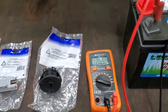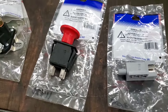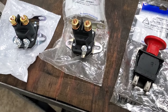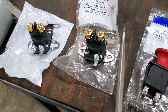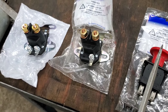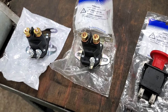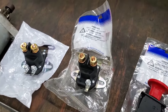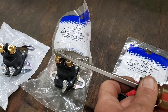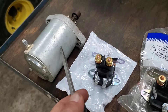We're going to skip the safety switch and the PTO switch for now, but we'll come back to them. Once you know you've got good voltage, the quickest way to find out if your starter is working — this terminal goes to the positive on the battery, this one goes to the starter. Take your screwdriver and jump across here — it will spark. That'll send power directly to your starter motor.